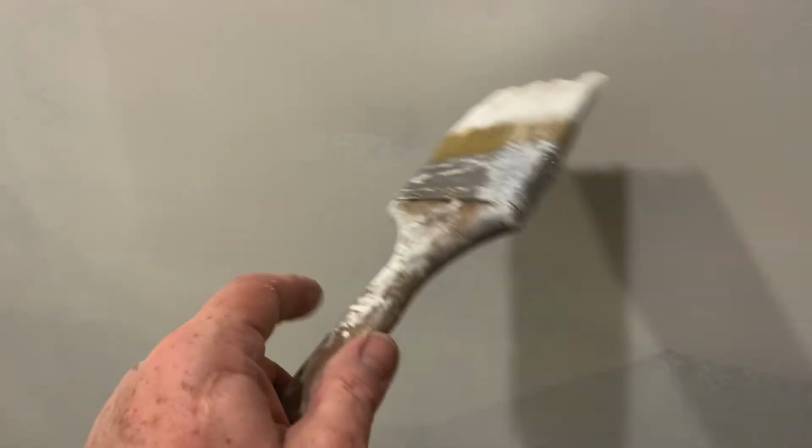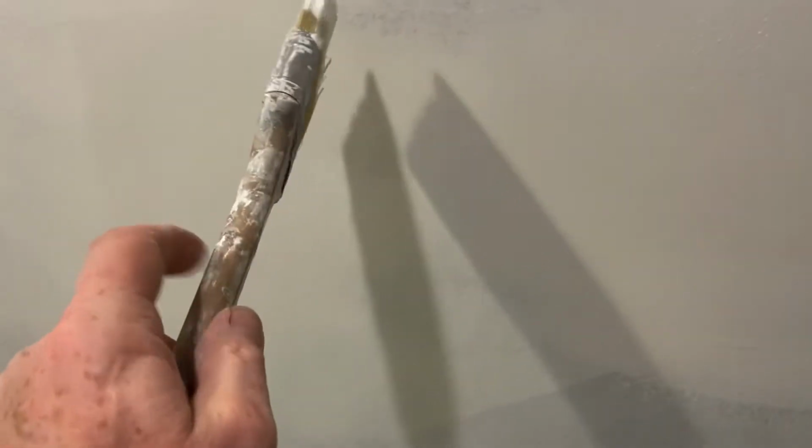But you don't want to put your wall covering on the wall with these air pockets forming. So you have to realize that you need to give it time. That's all I'm trying to let you know. And let me remind you that the bubbles are coming from the plaster, which is drying underneath this primer. So that air is escaping, manifested by the multiplicity of bubbles that you saw. We didn't just get bubbles here and none here for no good reason. We got them here because this is still curing. So just be careful of that.